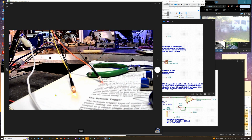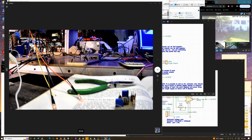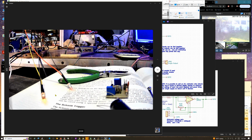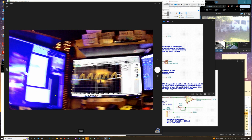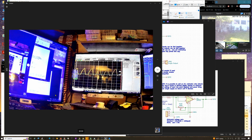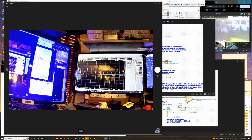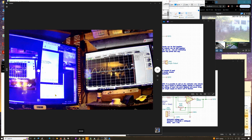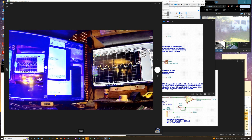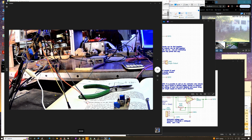I can't take this down to as low a frequency because originally I had this large electrolytic here, which is like 1,000 microfarads. I was trying to adjust the DC level, and see, there's what it does to the waveform. It's already clipped because I have it turned up to full voltage. So the device is clipping it, and putting that resistor on makes it worse than having no resistor. If I take those levels down, it's still going to ride on the lower DC.